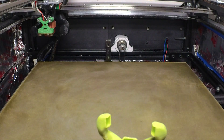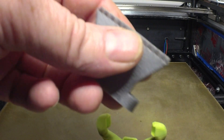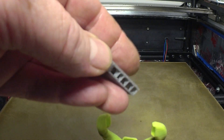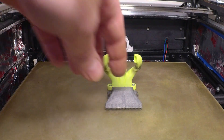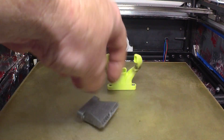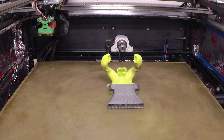So I came up with this idea to create this little duct here, printed it out of PETG. Sure enough, the bow of the Benchy was solved. However, the stack was a mess. Even though this fanning duct cooled the bow really well as it fanned out, it just wouldn't work for the stack. Even the columns of the Benchy didn't work that well. I thought, if I could just have both in the same duct, that would be really nice.